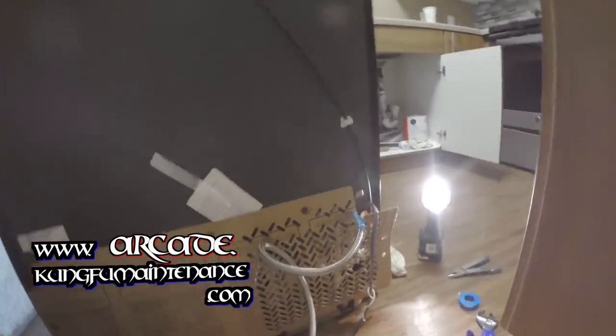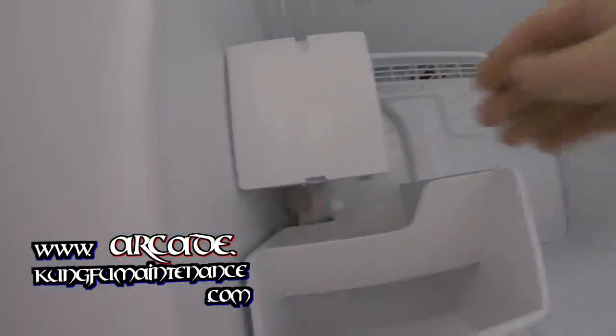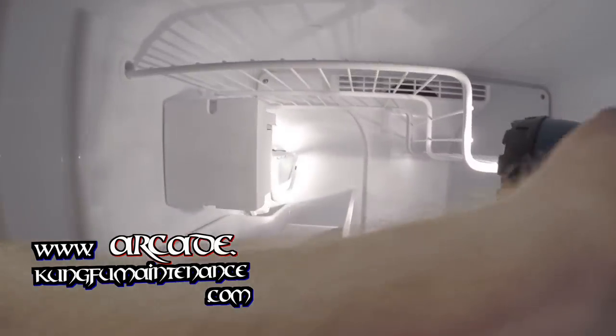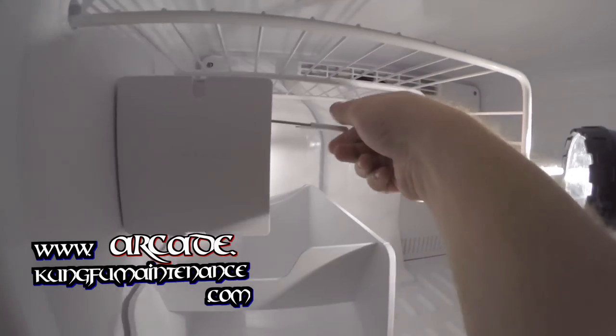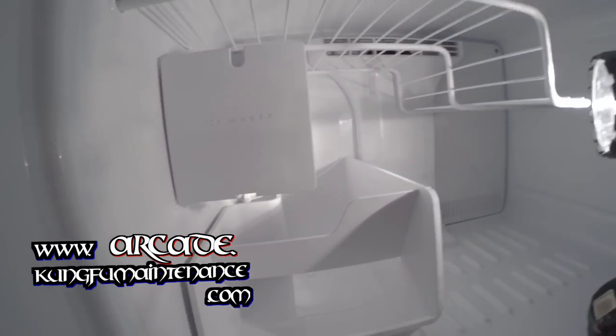That's how to set up an icemaker. Now we'll just want to wait 48 hours. Inside the machine, we'll be able to move our harvest bar down. Right there, that'll turn the ice on, and as the ice fills up, once it reaches its full capacity, it'll turn off. But anyway, there's turning the harvester down. We're ready for some ice and some ice making action.